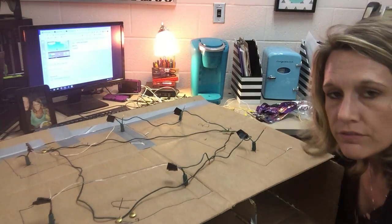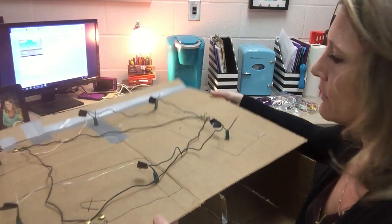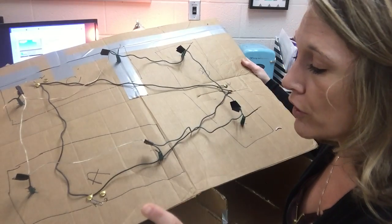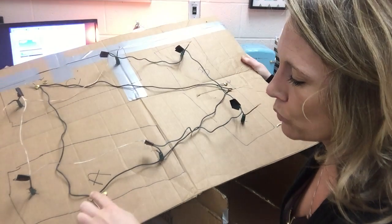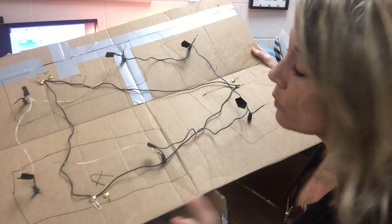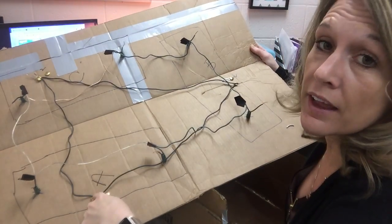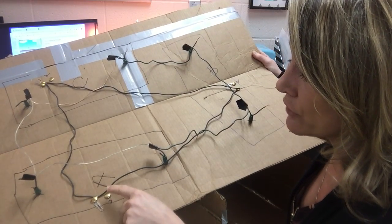For this next video, I'm gonna show you how to do the next set of wiring. We have already hooked up our load line, which is what you initially did with the black tape. We also did the first part of our hotline. We have two sides to each switch — switch A side one and two, switch B side one and two, switch C side one and two. What we did was hook all our side ones from each switch together: A1 to B1, B1 to C1, and C1 back to A1. So we've got one half of our hotline done.